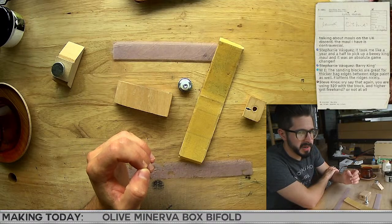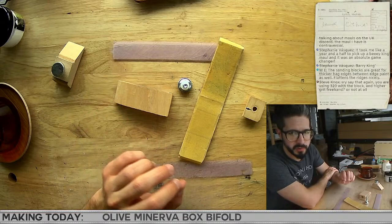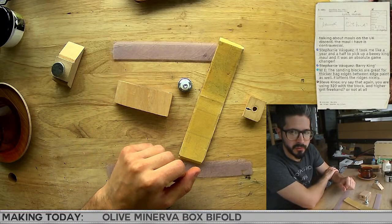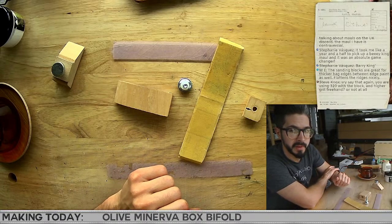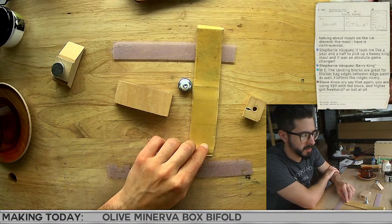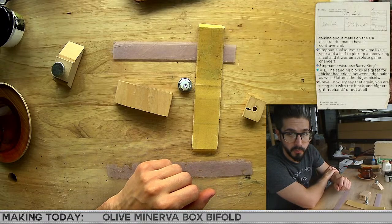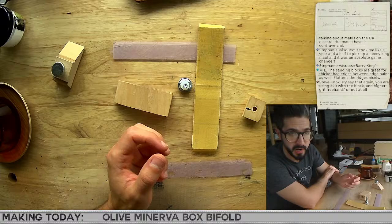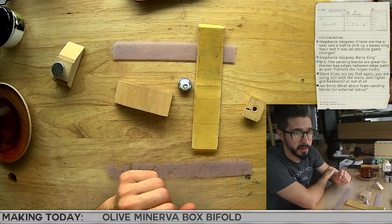In my usual sanding steps, I'll usually go from 320 to 600, and then I'll finish with Tokonole with 1500. I actually use water for everything other than the very final burnishing pass. Again, I talk about this in more detail. There was a live stream I did a couple weeks back where I did a burnishing test, and I kind of showed my whole process of it. If you're curious about that, go check that one out.